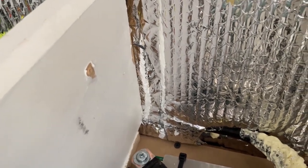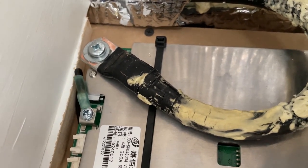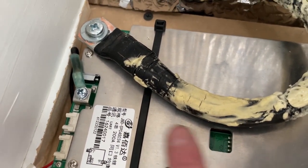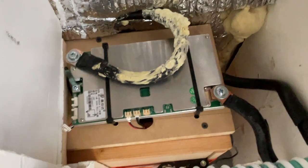Note that you want to make sure that your wire connections don't contact this top plate of the BMS. Honestly it's a pretty awful design having the connections so close to this plate — they are slightly higher than the top plate but you still want to be careful that it doesn't short out through this plate. Also make sure that you don't hit the screw right there and short out through that. Kind of a goofy design honestly.